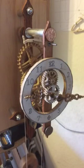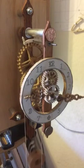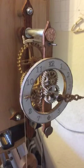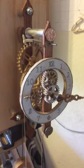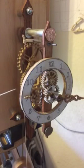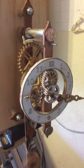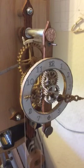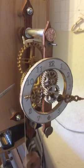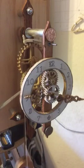This is Brian Law's Clock 13, which he released in a very condensed size. The entire height of the clock is 11 inches, the diameter of the escape wheel is about one and a half inches, and so are all the other gears. This is completely cut from wood — not like the original design, which is destined to be printed by 3D printing. I actually made one 3D printing version of the clock; this is my rendition of the same clock cut in wood, and the gears are working fine.